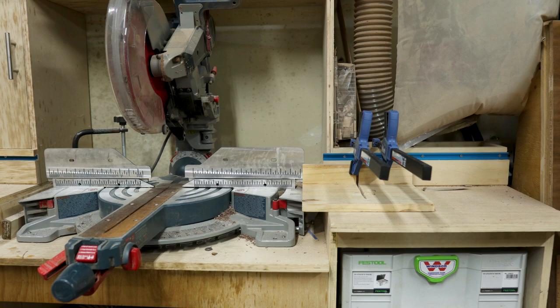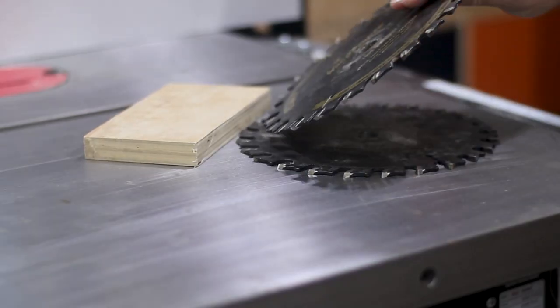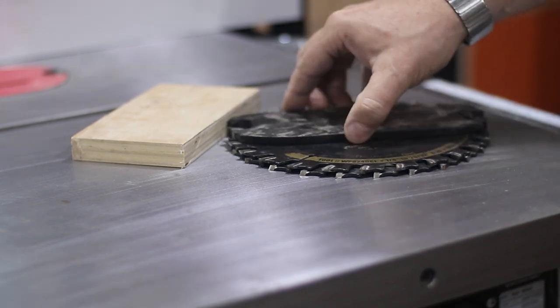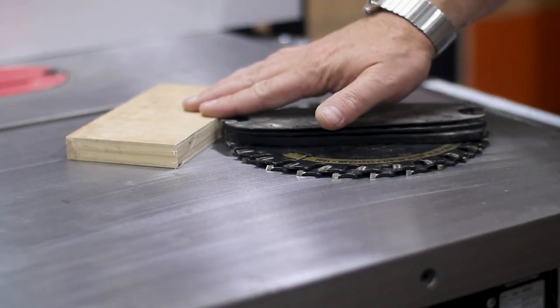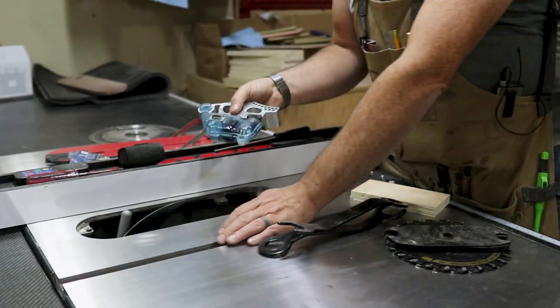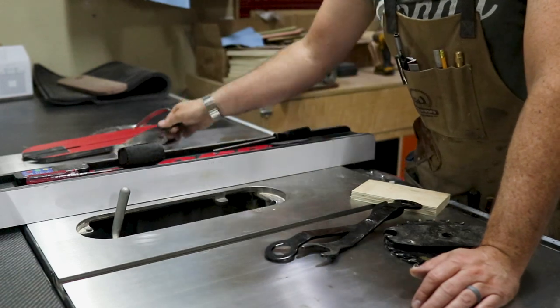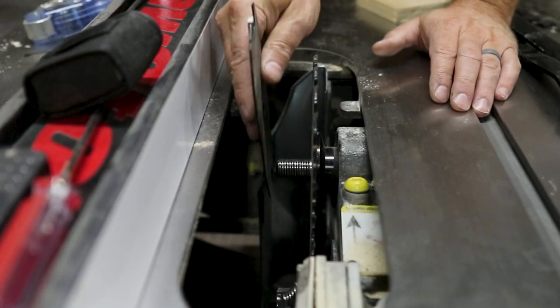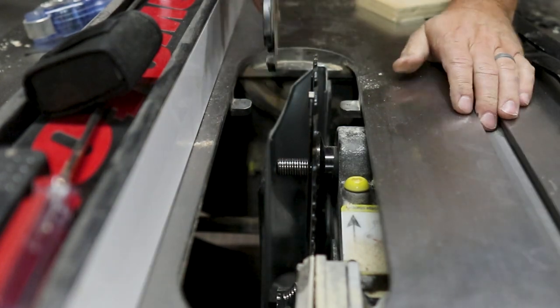Here's a good example: I had to cut the inside dividers for the lower shelf pieces, and I just set up a stop block for that. I was feeling a little extra, so I decided to do some dados for joinery just to make things a little bit stronger. It's not something I've done before, so I wanted to mess around with this technique. I also took my time setting this up on my SawStop, because this is the first time ever actually using a dado stack in it.